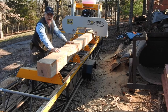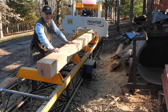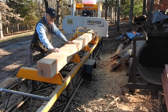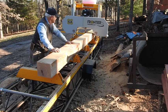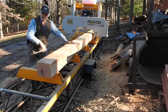Clearly there's something wrong. I'm doing something wrong, because I definitely was not crowding at that time, and I had the guides where they needed to be and only made one or maybe 1.5 passes and threw another blade. That's kind of concerning me.